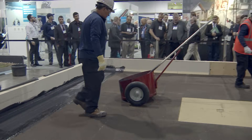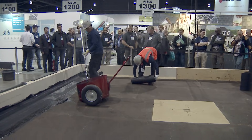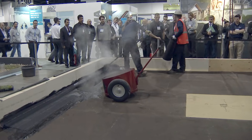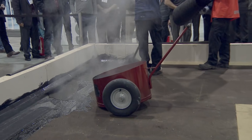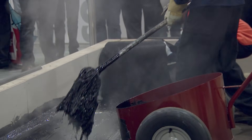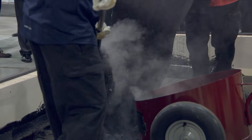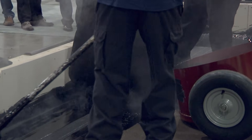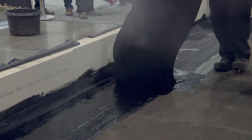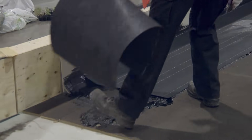There are three types of felt: glass felt, inorganic glass, and organic felt. Now they'll do a three-quarter roll. There's also the original organic felt, number 15 felt — you can marry the two of them, there are different application procedures. The learning curve with glass felt is you can't walk on it. If you walk on it, you displace the asphalt and you have a leak. We want a continuous layer of asphalt, about the thickness of a quarter — that's the perfect thickness — and that gives you a nice true four-ply.